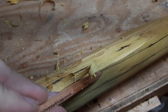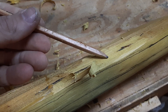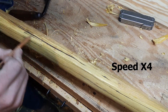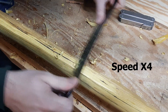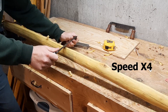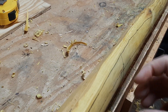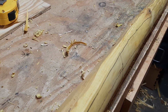I am almost down to the edge of where my bow is drawn out and I just now got through that little groove from the grain tear-out. There's still some there and you can see it comes up this way. As you start to cut out the side of the bow you want to see shiny smooth wood. If it starts to look rough like it's tearing out, do something different — scrape it off or sharpen your draw knife. Make sure you're not ripping that wood off.